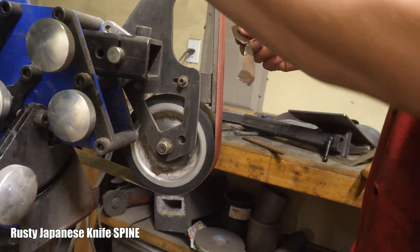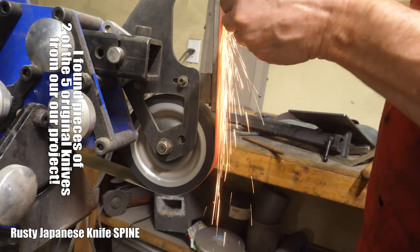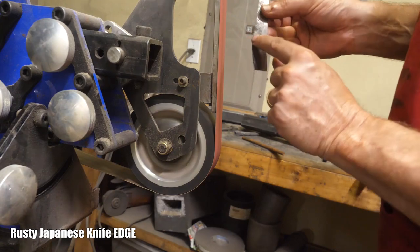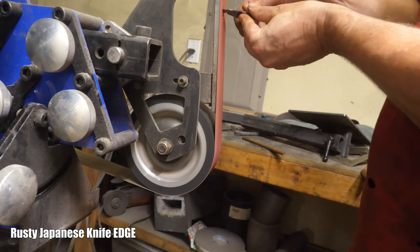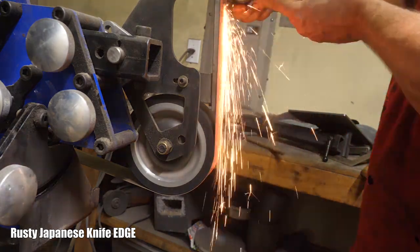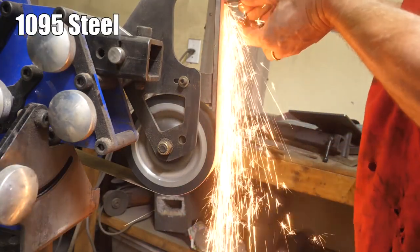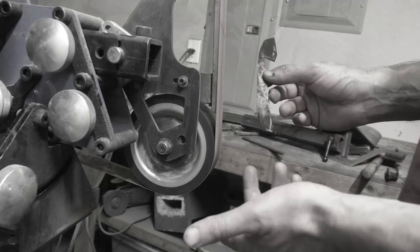Here's some of our leftover knife pieces. This is the back of the knife, or the spine, and it's got sort of orangish long sparks that don't do a lot of bursting. Now here's the edge portion of the blade — identical. Lots of long sparks, slightly orange, don't do a lot of bursting. Definitely doesn't look like our simple high carbon steel. We'll come back to sparking a little more later.